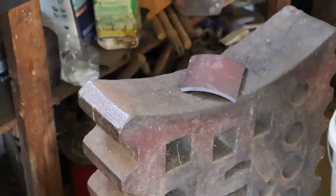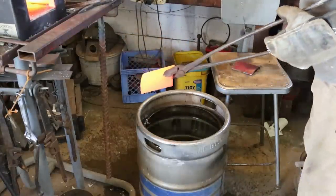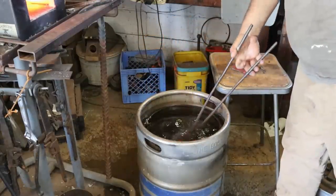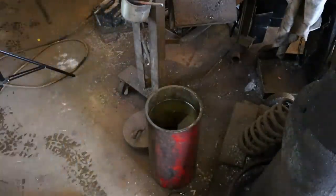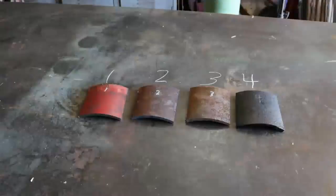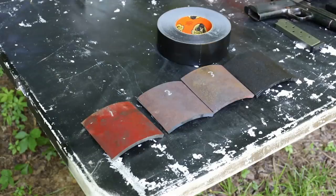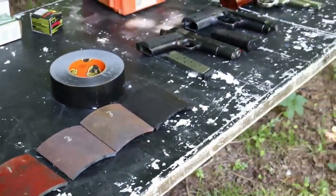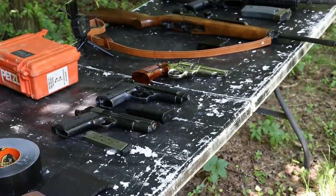Let's see if the tongs are magnetic — the plate is not magnetic. Normalize it; it'll take a while to cool off to room temperature but that'll just relax all the steel. Same procedure — non-magnetic, quench in water. I've thrown on some gloves and a face shield because all my test pieces are heat treated, so it's time to do some shooting. I'm going to take these to a log and shoot them with progressively more powerful calibers to see which one takes the least damage.